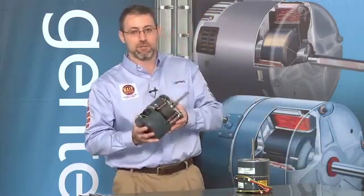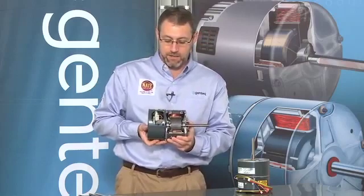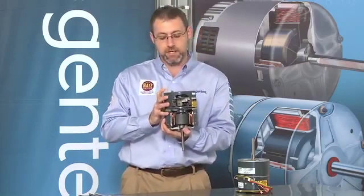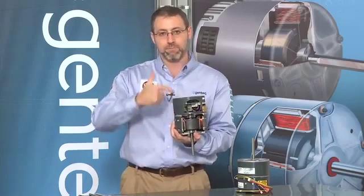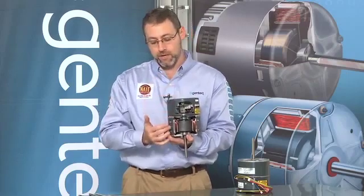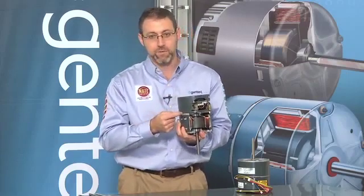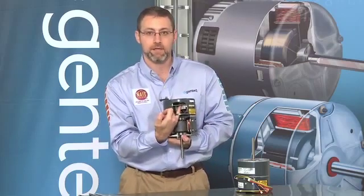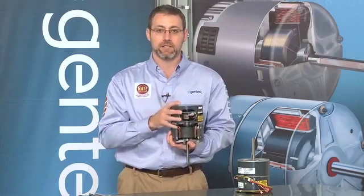The mounting of the outdoor fan motor is not really anything special, but I like to explain it because sometimes when you look at it something just looks a bit off. We like to mount all of our outdoor fan motors — I'm going to use this variable speed motor to demonstrate — in the shaft down position. Using this cutaway you can see that the molded portion of the can would force any water that got onto the control to roll down and off, and even if it got in between the control and the motor there would be no way for that water to be pulled back up by the control and cause any damage.